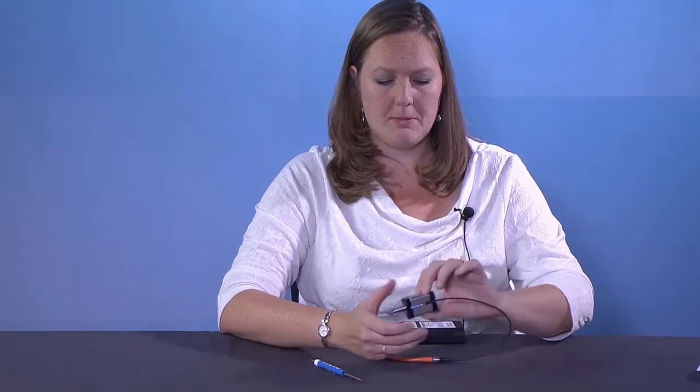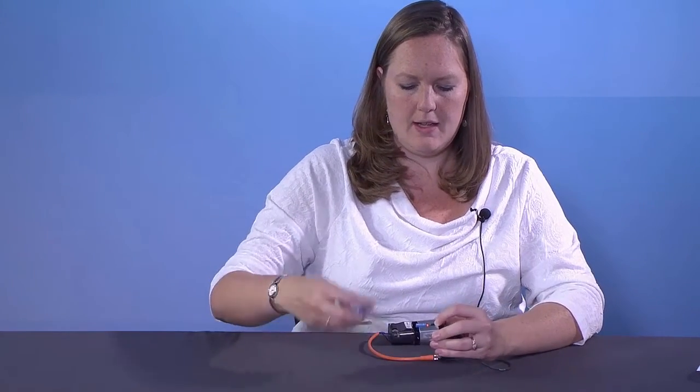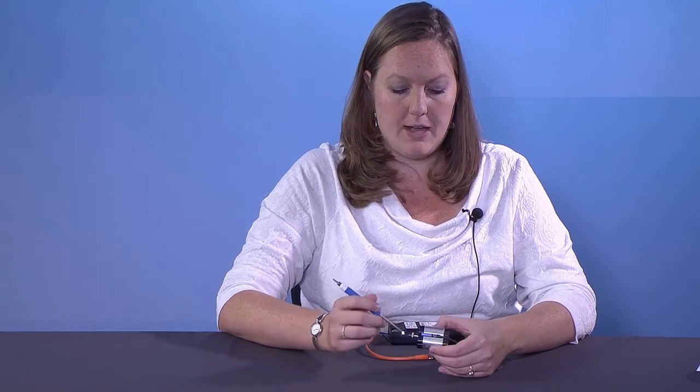Next, let's talk about setup. Here's the MZT7 and setup is really simple. We simply do drop-in mounting to a cylinder from above, and it's not going to fall out due to those retaining ribs. We find the spot where it lights up and it's detecting your magnet inside. We can use either a flathead screwdriver or an Allen key — a quarter turn is all you need and it is not coming out of that slot. You can turn it off by moving the piston; you could have another one to detect the off position and other end position. It turns back on and detects it every time. And that's as easy as setup gets.